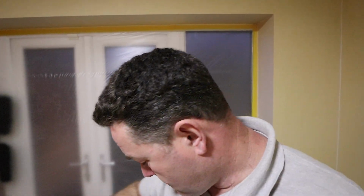Doing a little bit of testing there. Now, when I opened the can, it actually feels quite a thick, very viscous paint. I tipped enough out into my pot, and then I added, if I say 5 to 10%, it might not be as much as that, but enough water that when I mixed it up, and I get it running off the mixing stick back into the paint, it actually flowed nicely into it.